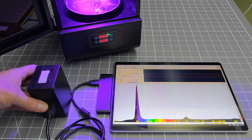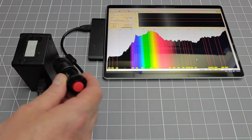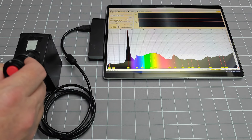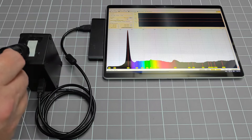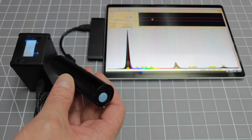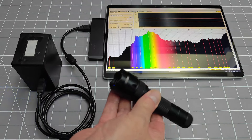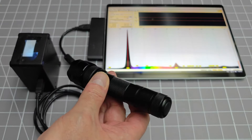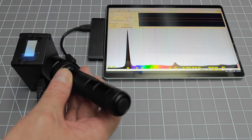This is my smallest UV flashlight. It seems to have a spectral peak at around 365 nanometers, but also has quite a lot of other light in its spectra. Here is another flashlight that has the same 365 nanometer peak, so it is going to be useful for these experiments. This one has the same characteristic peak but appears to have a higher radiant flux, so I will use this one for testing.